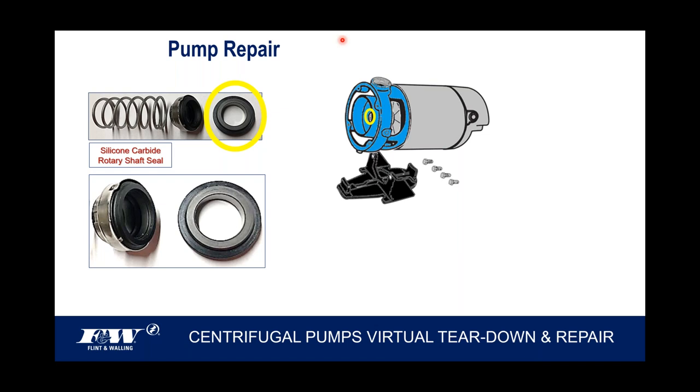First of all, there's a cavity that's built back into this motor mount. So it's a cavity that sits back there. And the first thing that goes into that cavity, this seal's got basically three components. You've got two face seals here that I'm bouncing my cursor back and forth on, and then you've got the spring up above. But this face seal over here on the right-hand side, to best describe that to you, this silicon carbide sits down into what looks like a little rubber tire from a model car, okay? So that sits down into a rubber tire. Well, that little rubber seal there on the outside of that silicon carbide has to push back into that cavity.